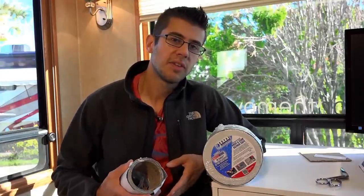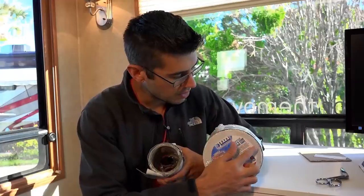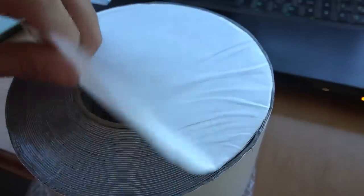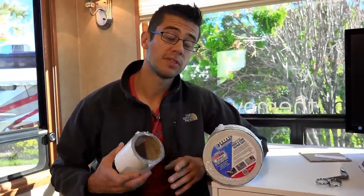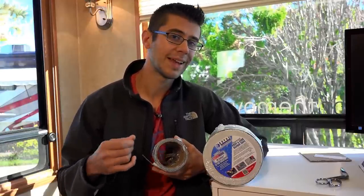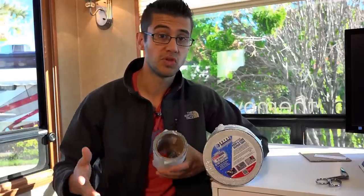Some of the cons though: it can be a little bit messy to store. The edge is kind of exposed to that rubbery gooey material that sticks to the roof. It does come with a protective material that is supposed to keep it from sticking to stuff, but as you use it, that kind of peels off and if it rips a little this stuff can stick to anything and be a bit of a mess. It also will not stick to a wet surface, so you need to make sure the surface is dry and relatively clean from large debris. It's not designed to stick to an asphalt roof, although they do make a larger version for that. The general roof seal is designed for a relatively smooth dry surface.